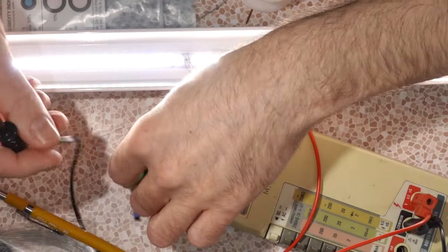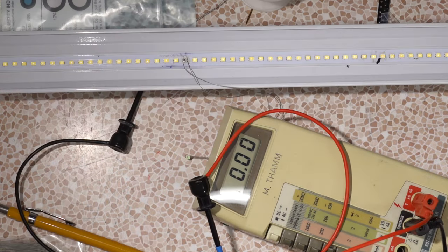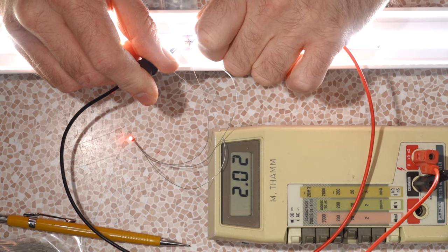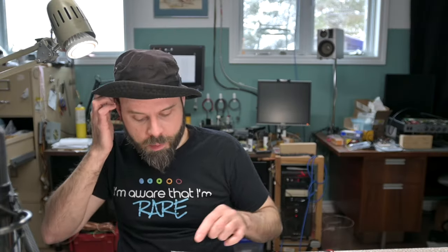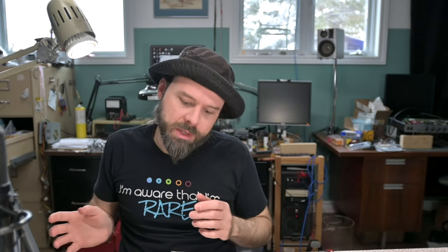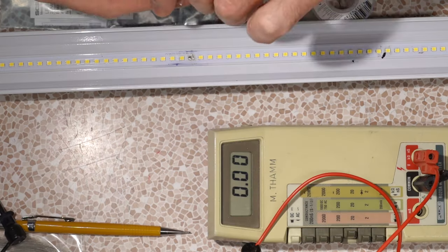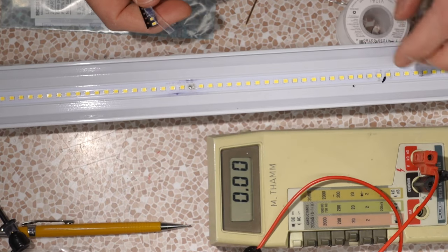What kind of voltage drop are we gonna see? 3.2. Now that's with the green element. What happens if we connect the red element? See, 2.03, there's a whole voltage difference. So the red is actually more powerful than the stock LEDs, but the greens are less powerful than the stock LEDs. So these tiny little guys here, that I don't even remember what their part number is,